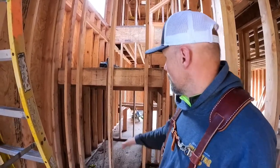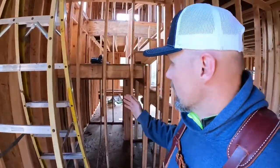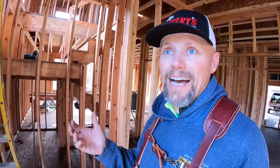Okay. And the size of door and frame, it's going to be a pre-hung door, a 2'8" by 5'0" door. So 5 foot tall. Some things to think about: just like my other interior doors, I'm going to have a jamb on both sides, which typically is 3/4 thick. So 3/4 on each side with a 2'8" door, that's 1.5 inches, that's 2'9.5" plus 1/4 inch of shimming on both sides.